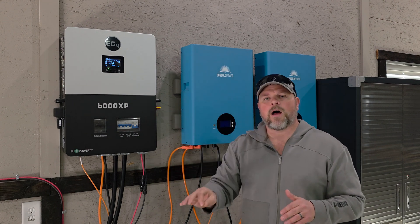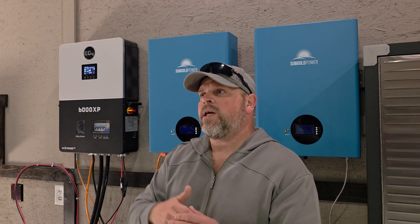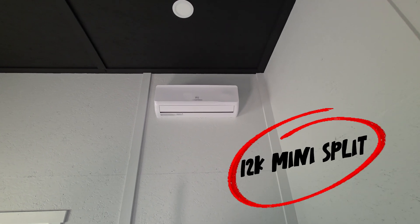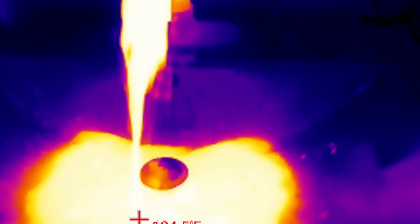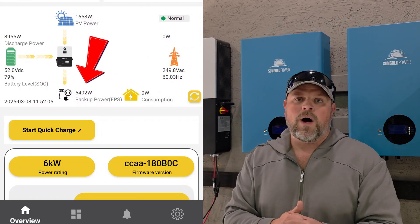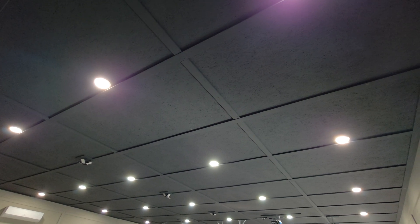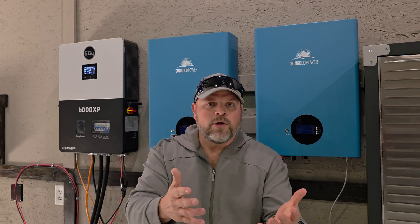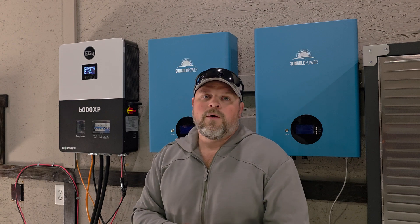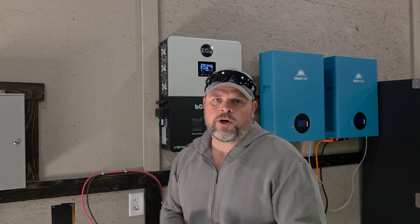This has performed flawlessly. Let's take a look at the items it actually powers — sometimes all at the same time. I try not to have the mini split running at the same time as the hot water heater because that hot water heater runs around 4800 to 5000 watts just by itself when heating water. As long as we don't have anything else on when the hot water heater is on, we're good. We could push it a little with lights since they don't use too much power.